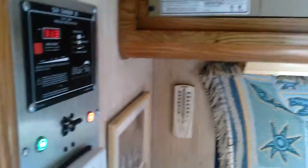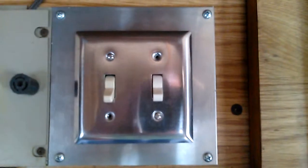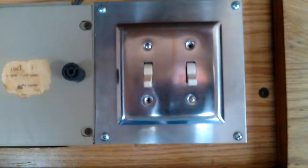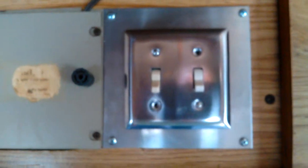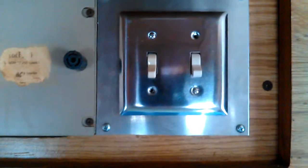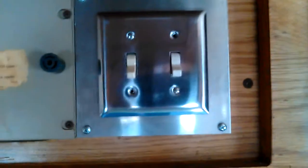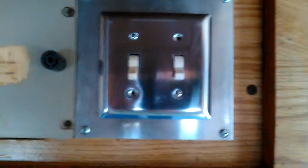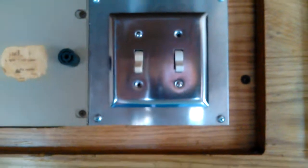The dogs are laid out and I don't blame them. I had what they call a power switch up here and it didn't work — it's supposed to flip back and forth between the generator and house power automatically so you don't blow anything up. Since it didn't work, I put my own three-way switch in here. And then to keep from running my battery charger off the inverter and really spinning my wheels, I put a switch here for the converter too, so when I am running the inverter I'm not charging the battery.